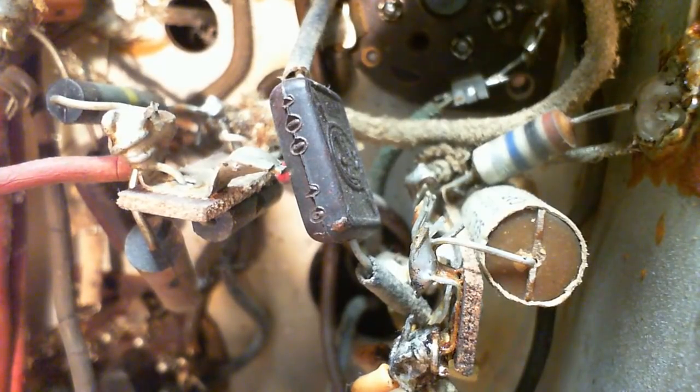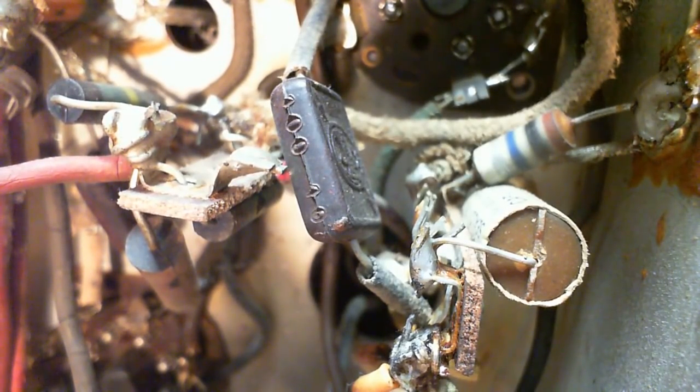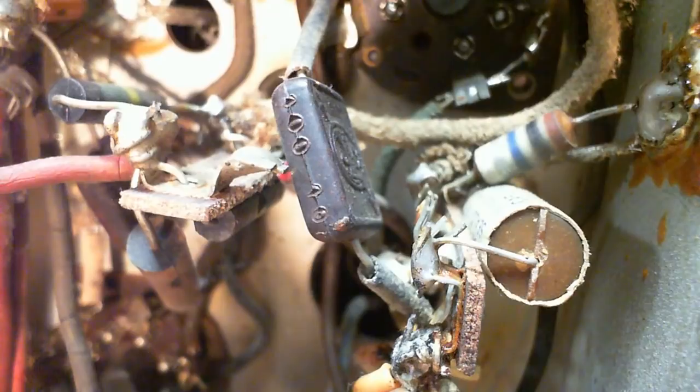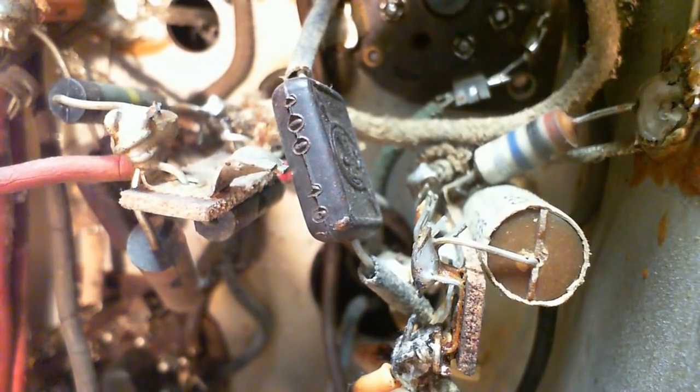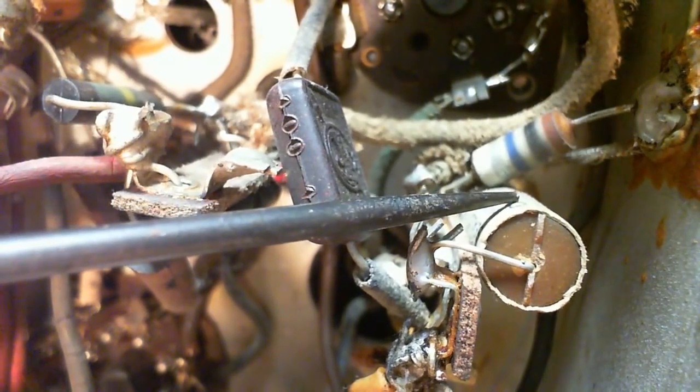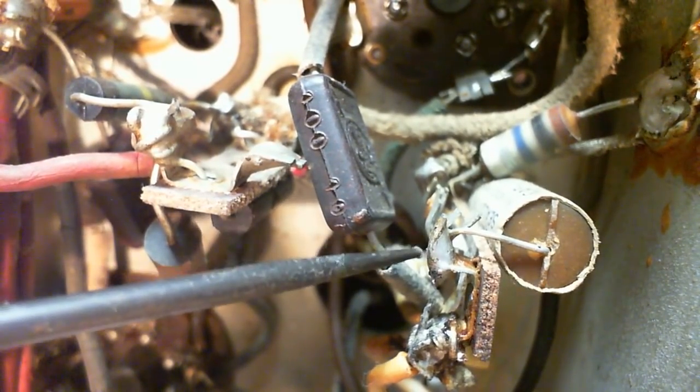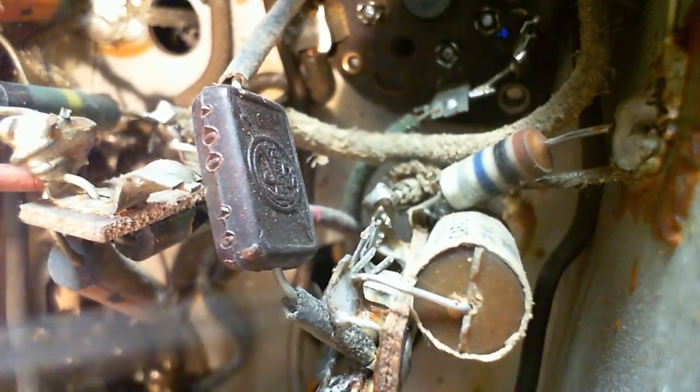Let's take a closer look at one of them and see if we can figure out if somebody's redone it or not. Okay, I gotta refocus here. Get a little closer look. Wow, that's a real eyeful, isn't it? Wow, there's a lot of stuff to look at there. Got a poker and a pointer. So, let's start with this capacitor. Is this a replacement? Did somebody come in here and replace it? So I'm looking for, you know, too much wire around the post here because the old part had something different about how it's soldered.